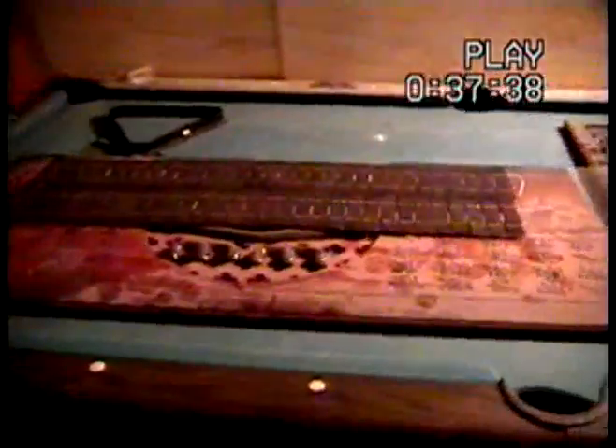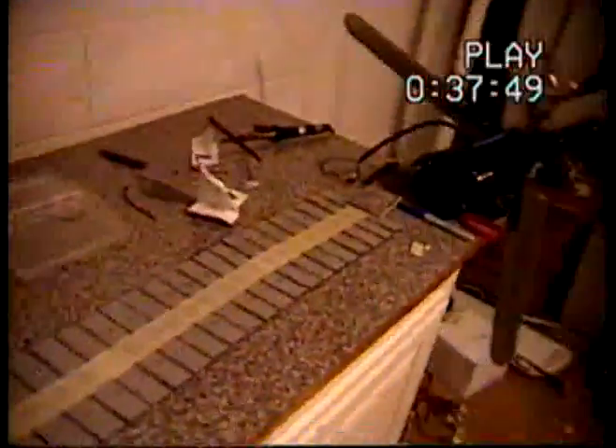I'm also working on another solar panel. I bought these off eBay as well — all these little cells, they're a lot smaller. I have 32 of these going in one strip to get, I think, about 17 or 18 volts. I got two strips right there — I'll wire those in parallel once I get all the strips done. That'll give me hopefully around 60 or 66 watts. There's one more strip over there that I'm working on. I've still got to put that last cell on to get my 32, then those will all be in parallel.